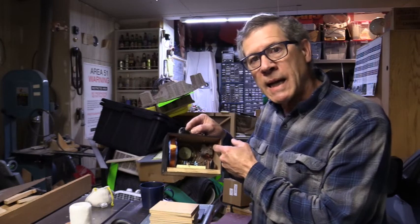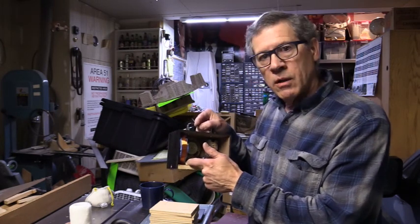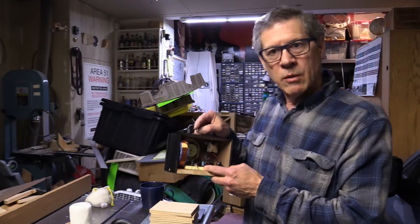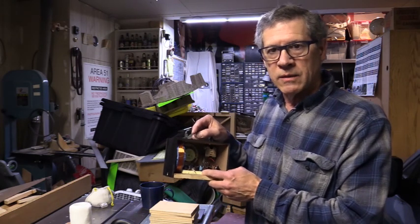Variable cap in the back. I'll show you a close-up. And put it all on a little proto board. If you make an FM radio, don't use a proto board. It acts a little squirrely at those higher frequencies.